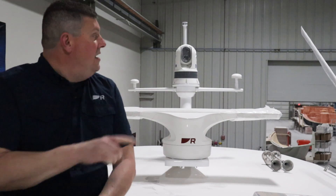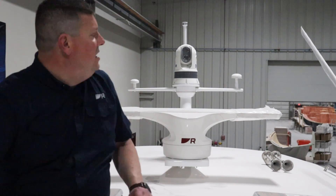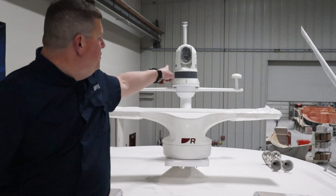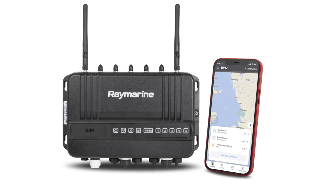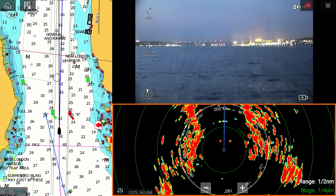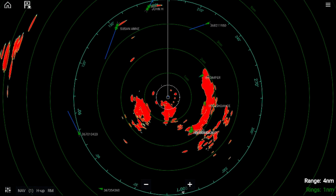The FLIR is a pan, tilt, and zoom camera controlled via joystick or touch controls on the Axiom XLs below. From its vantage point on the mast it can see 360 degrees and tilt plus or minus 90 degrees. To the left and right of the FLIR are two small mushroom antennas: the one on the starboard side is a GA-200 GPS antenna tied into the Axiom XL2 screens, and the other is an antenna for Yacht Sense Link — the 4G marine mobile router that provides internet access, Wi-Fi connectivity in port or marina, and internet to any devices on board. In the center of the hardtop is a Cyclone four-foot radar, providing visibility of targets out to 96 nautical miles — a solid-state chirp radar great for coastal navigation and collision avoidance.